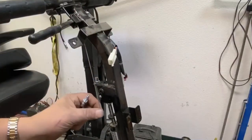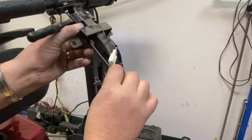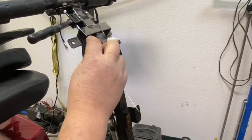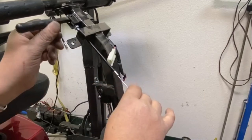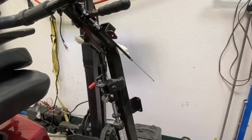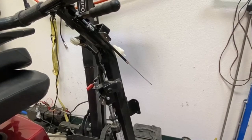You may need a screwdriver just to help it through the bottom portion of that bracket. I'm using a wrench to locate it — pull that through. Then you can put your sheathing over the brake cable sheath, and remember which orientation it goes, then just tighten that up. You can basically turn the outer casing of the brake cable — just so it's located and it's not going to fall out. The locking nut alters the distance from the bracket to the cable, so it takes up any slack. It has a locking nut underneath.